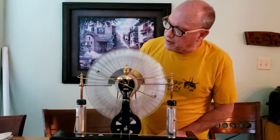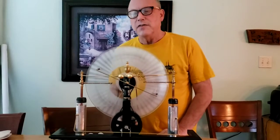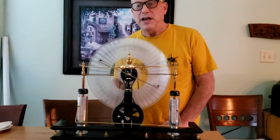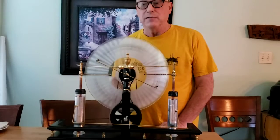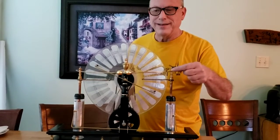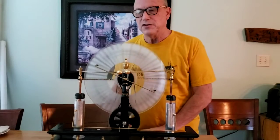Sometimes it'll misfire and it'll discharge across the charge collection combs. If I make the gap too wide, it'll keep discharging on the comb, on the brush. And this voltage, I haven't measured it yet, but I've heard that it can approach like 70,000 volts, so it's extremely high voltage. Let me bring this a little bit closer. I'm just shocked. It's got a lot of voltage built up into it. So now it will discharge.